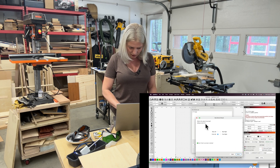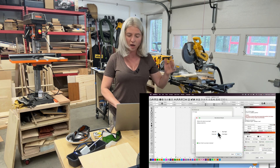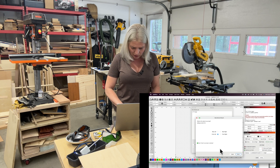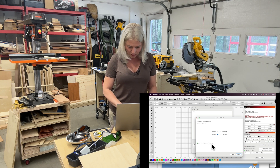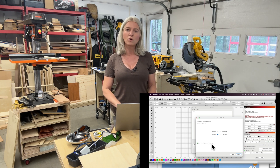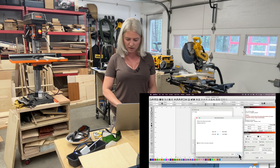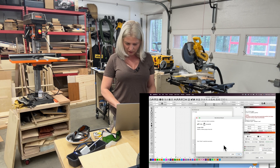What is your origin of your laser? It is the bottom left, so leave that one clicked on the bottom left. Now, I would click Auto Home when the laser starts. If you have the Longer 10 watt, I would suggest you do not click that one and leave it unchecked. Then click Next.